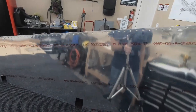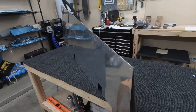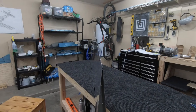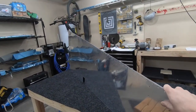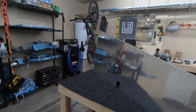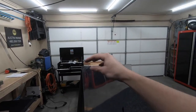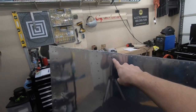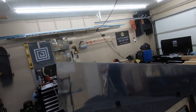I'm happy with the results. It's not the prettiest thing on the other side, and even the manual mentions it won't be perfect. Didn't get any warping during the process. Really nice and straight. ProSeal held up really well — it's a nice rubber consistency and just held onto it, making a perfect edge. I was really not looking forward to this leading edge with my mistakes to fix, but super happy. You'll see they blend in pretty nicely. There's one of the 1/8th rivets — you'll see them with the stars there, and they blend in just like the others.